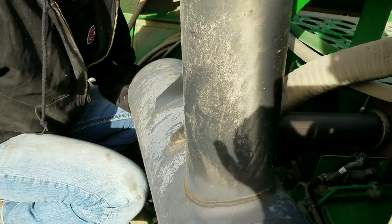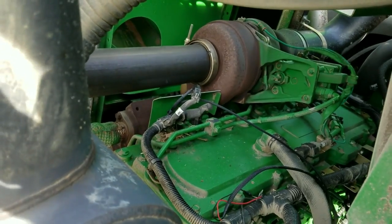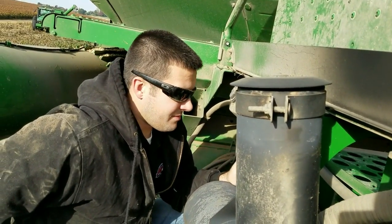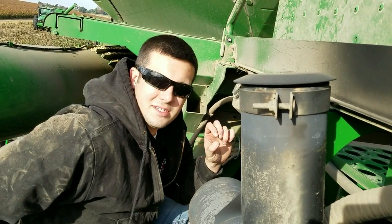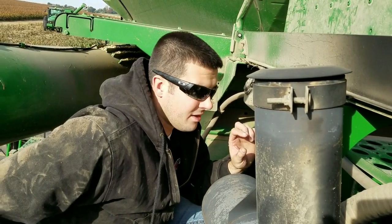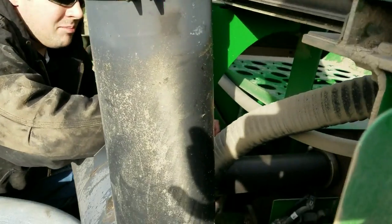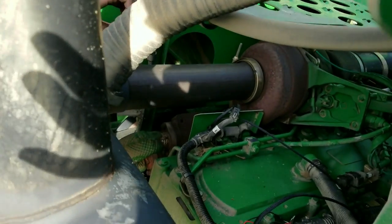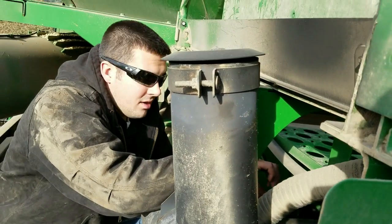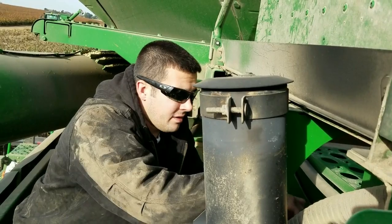You can see we've got our injector plug connected. One thing to note on that injector plug as well — always make sure that the two prongs on the harness line up into the factory harness. As you take it out, you can see there are two plastic alignment pins; make sure those go into the openings on the factory harness. Once you tighten that plug, it may not look like it's going to go in all the way, but only turn about a sixteenth of a turn on that injector plug. Once it's snug, don't do any more — we don't want to damage those pins.